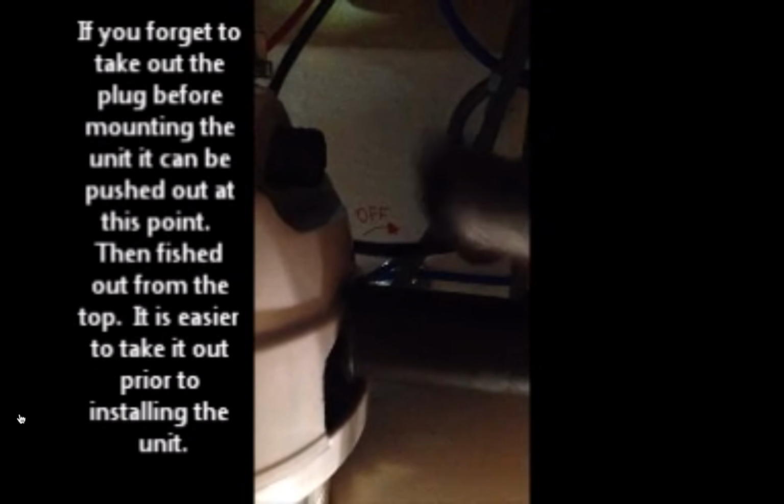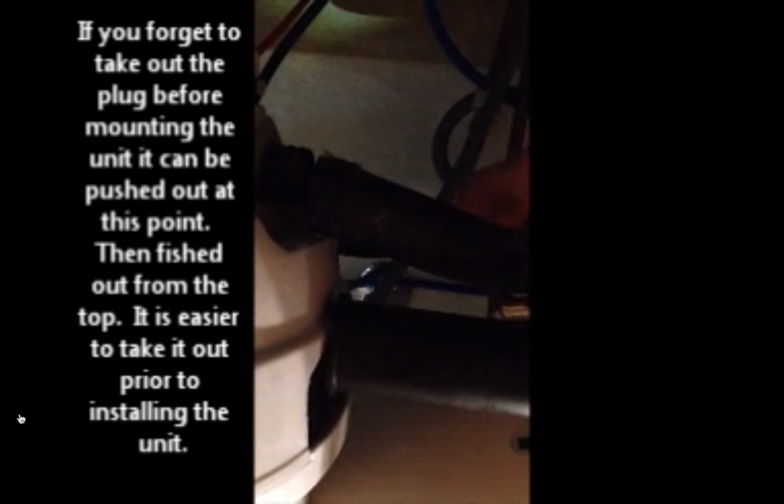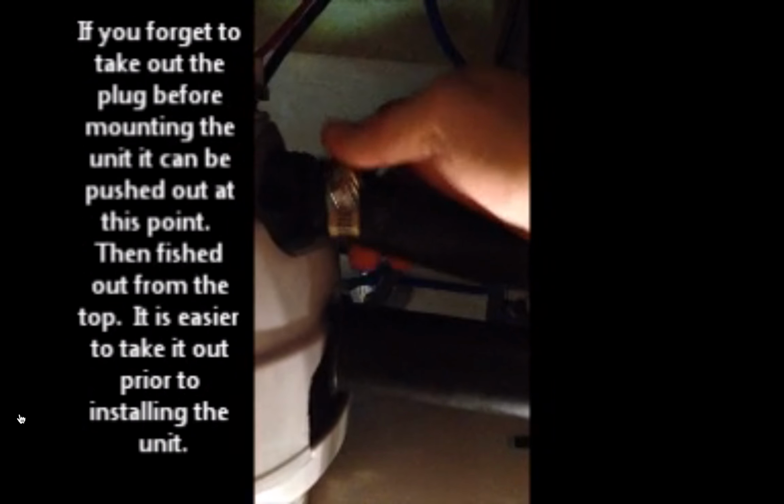And then I'm going to show you on this end. If you have a dishwasher connecting, you'll make sure you push out the plug that's on the, it'll go to the inside of the machine. Then this will fit in there. And this will go around it and tighten. And then this piece down here, the hose comes out a little bit more to get into the unit. And then it has a little gasket that will fit in there as well. There we go.